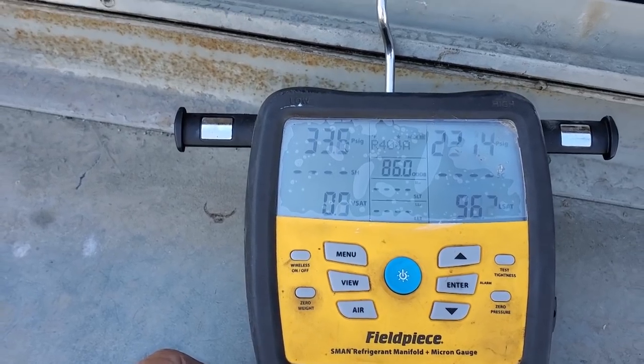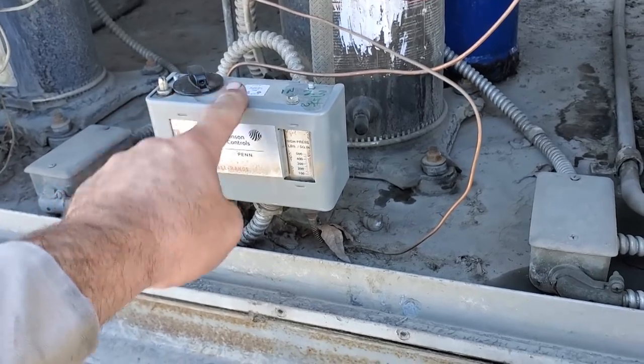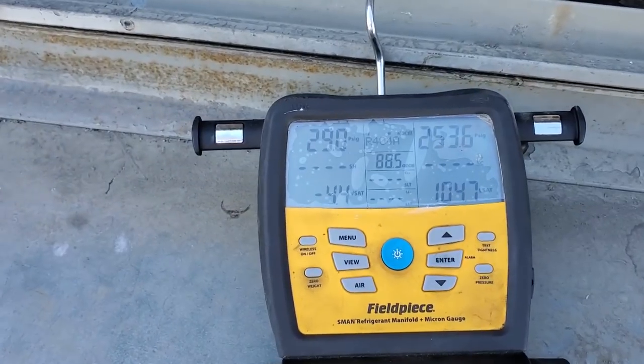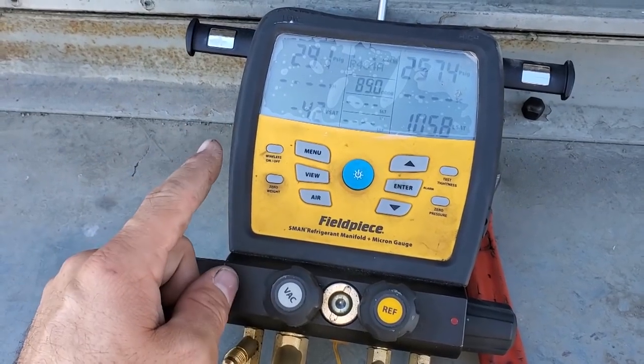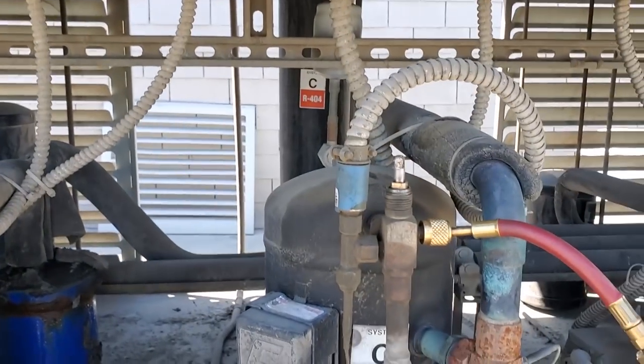This location actually is the one where I had the pressure control issue with the pressure regulating power head. And it's funny too, because I cleaned the rack that day when I made that video and the rack's already plugged up again. It's crazy how fast this happens. Flashing on a sight glass though — that's not good. So we're going to have to figure that out.